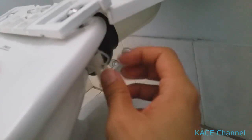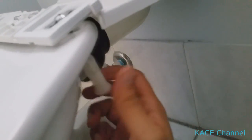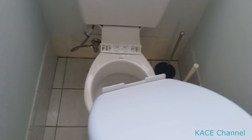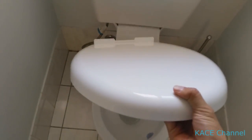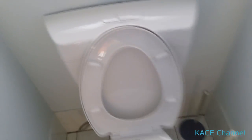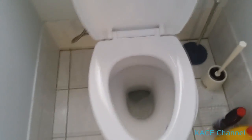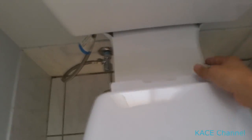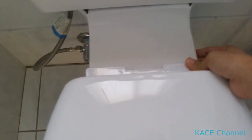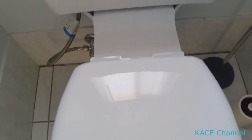The orientation of the nut is this way — turn the nut clockwise to tighten it. Now I can assemble the toilet seat to this fixture by sliding in. I've got the toilet seat assembled, so you can bring the toilet seat down, cover down. Because I haven't tightened the nut yet, there's some movement here. Now once you make all the adjustments, you can tighten the nut on the other side to finish it off.